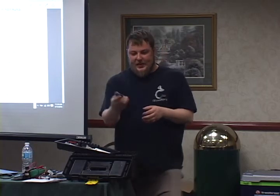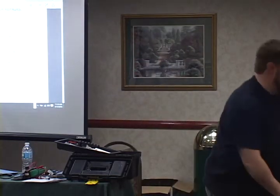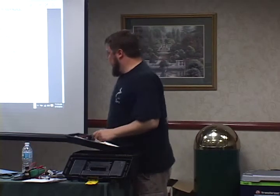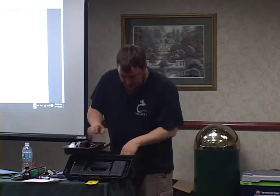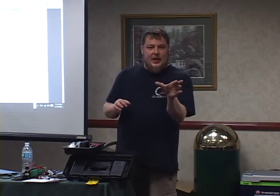Oh, look at that. It's just the difference between the two Toshiba pulleys. I'll pass them around. You were saying before you were grooving those pulleys? Yes. I don't have any with me that are grooved, but it's the 1/8 inch groove right down the center so that it can accept that new belt that Tom recommends to use.